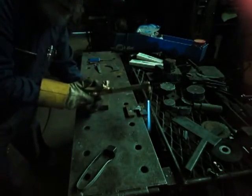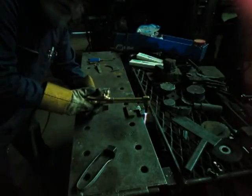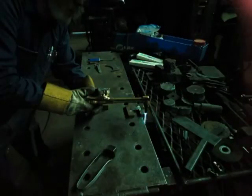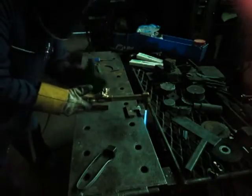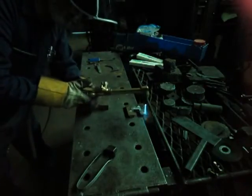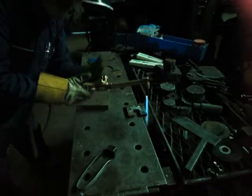Another thing is the closeness of your tip to the work. You run your tip too close, you're going to get it dirty in a short period of time. That'll mess your tip up, and then you'll have to cut close because it's not going to cut right. With a good, clean tip, you can cut as far away as that or farther and not have any trouble.